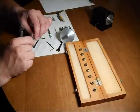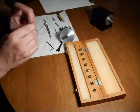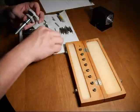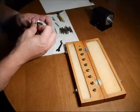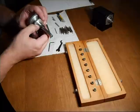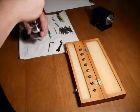I'm going to choose a heavier tension spring now. I'll set the screw into the back, drop the spring and the tooling ball down into the hole, then reassemble the arbor system. Find the ball bearing, drop it into the set screw hole, and tighten down the set screw until finger tight — the key is to allow for float. Should the operator set this up for long-term service, they may want to use thread sealant to seal that set screw in place. Then use the Allen key to set the tension of the tapping head to the higher tension setting.